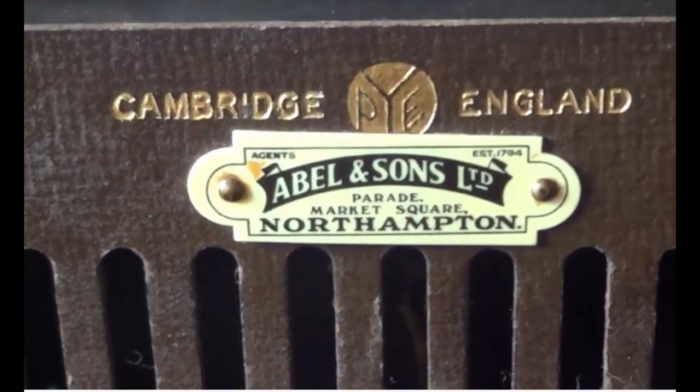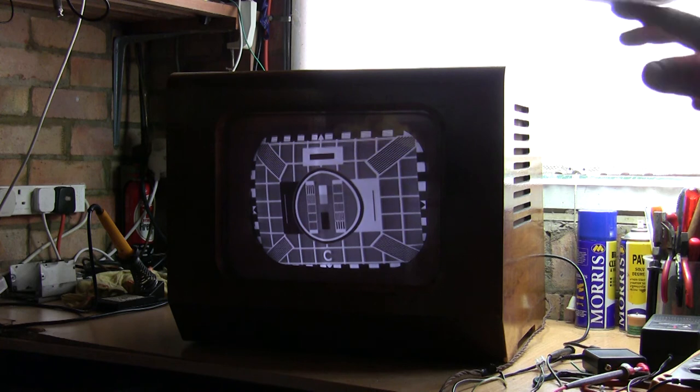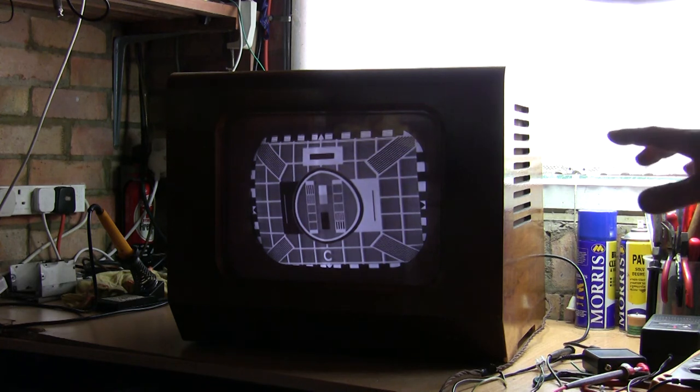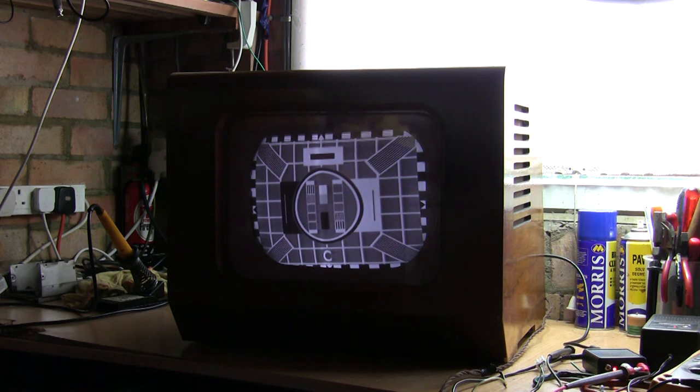So there you go — I just thought I'd share this joyous news. I've got a test card up on it. By no means is it brilliant — the picture is moving about, going in and out, and jittering at the top. But once you've got a picture on the screen and you're putting the test card through it, that's half the battle, because you've got something to work at and can look at stages of the set to work out what faults you've got. That makes it a lot easier, even for amateurs like myself.